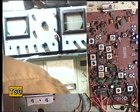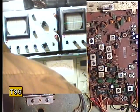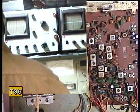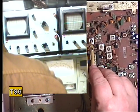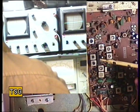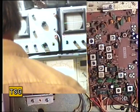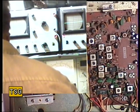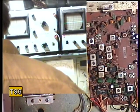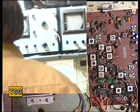So that concludes the transmit side and the VCO of this Uni-Ace 300 base station. The issues it's had — and remember I'm working on an external power supply because there's clearly a problem with this one — are: apart from coil L13 having been damaged, we were only getting about 2.9 watts, now brought up to 3.9 watts. The problem with no transmitted audio has been overcome by cleaning the mic socket. I think it's been in a nicotine house, which puts a film on things like that, giving dirty connections. At that point we'll stop, as I'll now have to change the audio IC or find out what's wrong with the amplifier, because on receive the audio is no good at all.